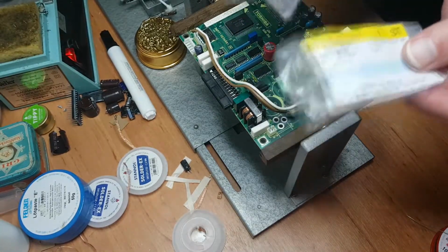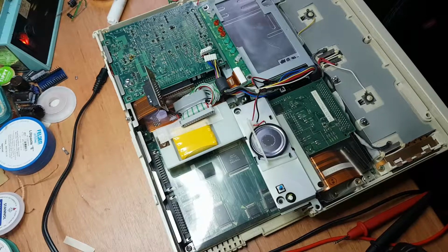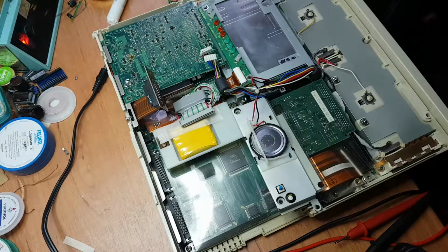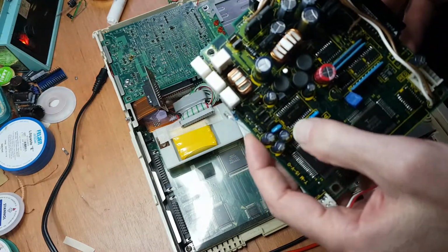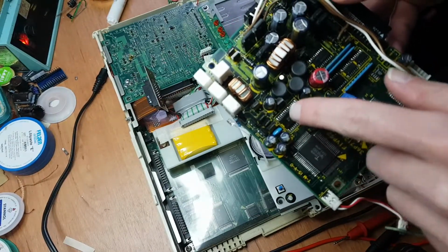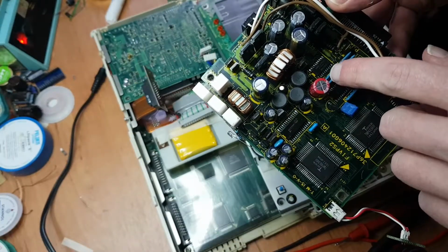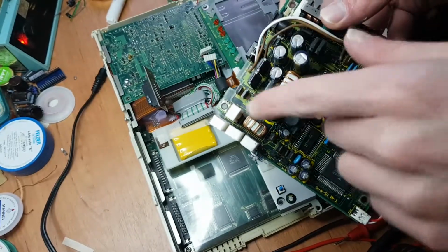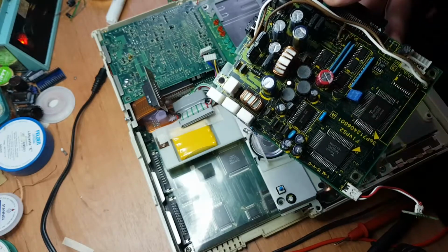Let's install these. So I've spent the last couple of days probing around the board, and I actually used my cheap Chinese logic analyzer to probe some of the signals going to the dedicated Toshiba IC, which is, I'll just show you on this one, which is IC3 over here, debugging some of the signals going from IC13 to there. And I have also measured the signals going to IC5, because this one drives all the PWM signals for the boost and buck boost converters.